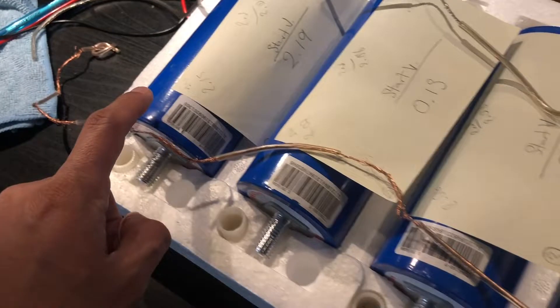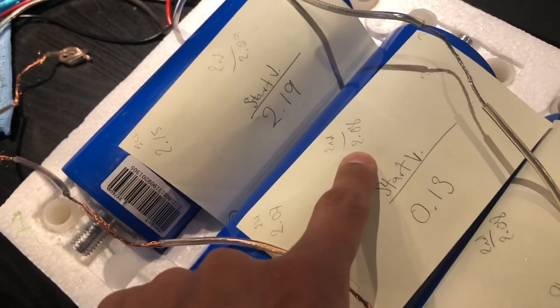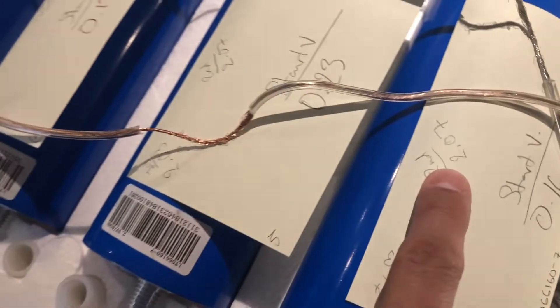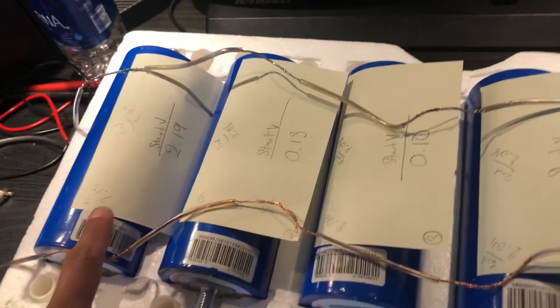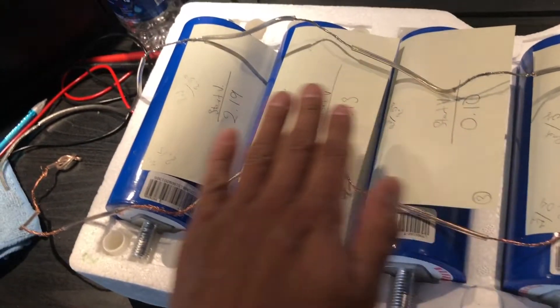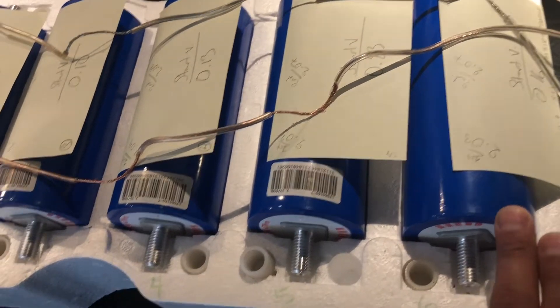That's not too far apart, but I still ended up going the 18 hours worth. What I came out to was 2.09, 2.08, 2.08, 2.08, 2.08, 2.07, 2.07. I figured out that if I had put the cell with the highest voltage toward the middle, it would have balanced out more evenly instead of putting it at the end — so the one furthest away from that cell received the lowest voltage.